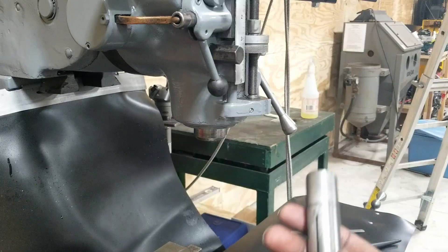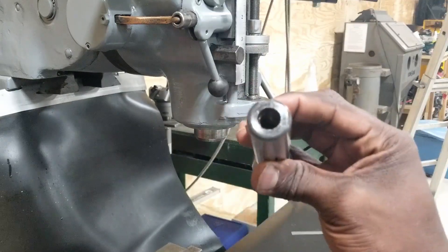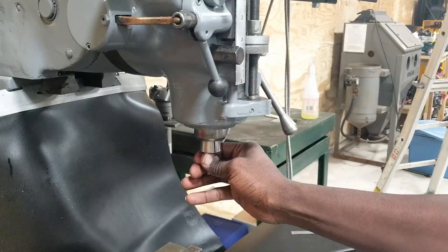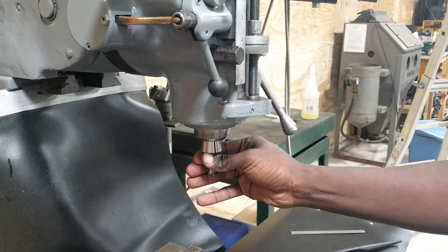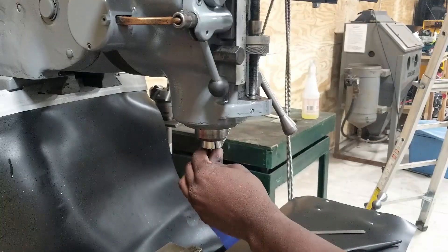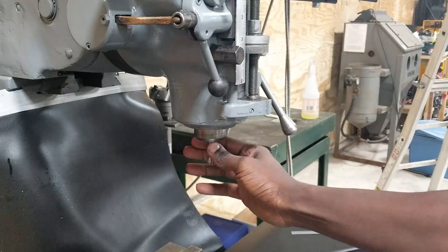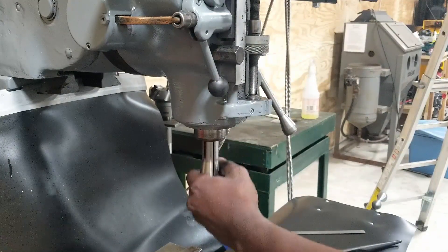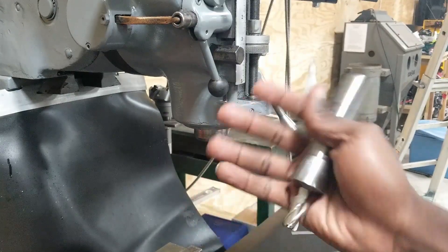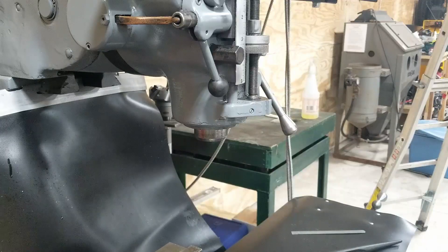There are still a few things to keep in mind. When you install this, you can still cross-thread it. So I put this in here, find where it seats in the little key, feel the draw bar, and then tap the 'in' button. Now it's engaged and then I can drive it home. And coming out — look how fast that is versus a hammer. I'm happy. That works. Well, that's it — that's the install. Fairly easy, fairly straightforward. Cheers.